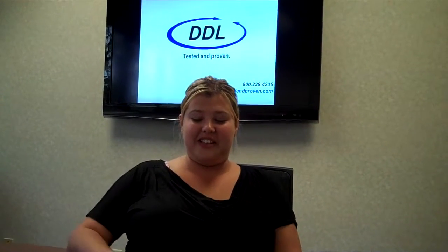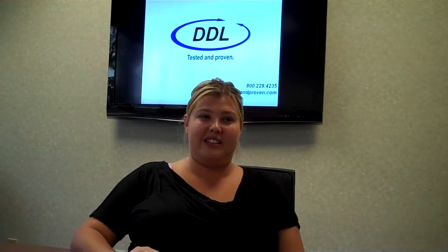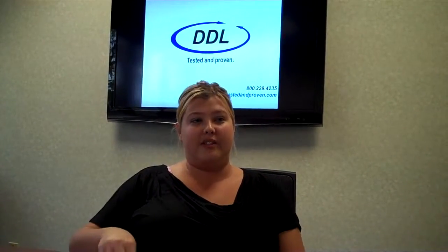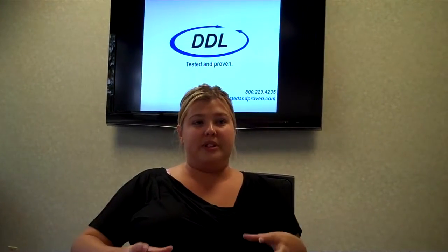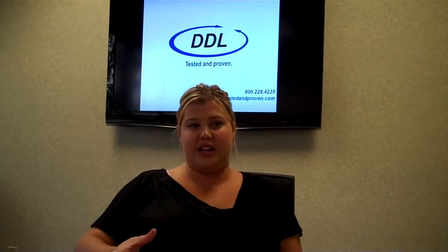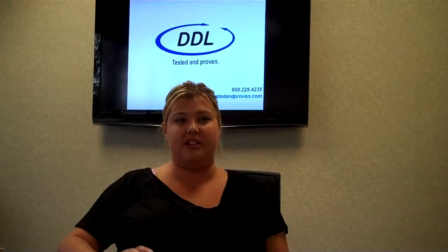What type of equipment is needed to perform shock fragility testing? First of all, you need a shock machine. You also need a signal conditioner and accelerometer. With the accelerometer, you attach it rigidly to the base of your product or somewhere within your shipping container, probably near the center. And then you attach your package rigidly to the shock machine.